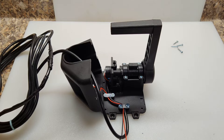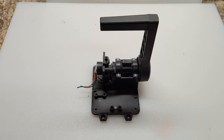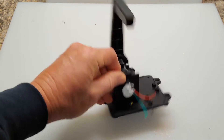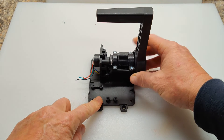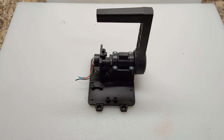Since I don't know what the micro switch does, I'm not going to need it. What I've done here is remove the wiring from these two connections and also cut the wires to the potentiometer and to the little micro switch. Basically, I tried running this as it was stock with the Haswing Pro2R 1.0 and it started out good and then it went wacky. So then I tried it again by adding the 1K resistors on there as Bassman Strikes has shown works, and it ran good for a little while and then it went wacky again.